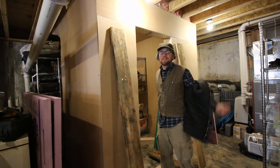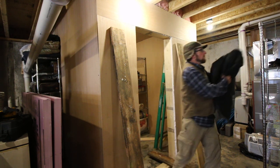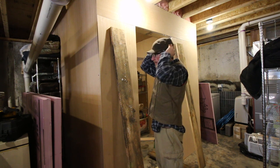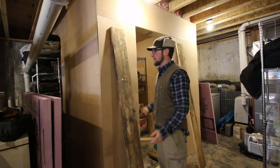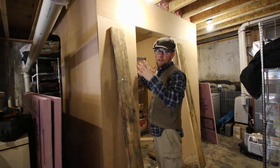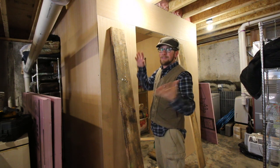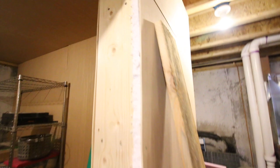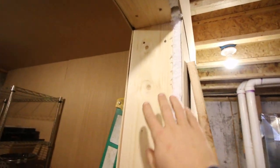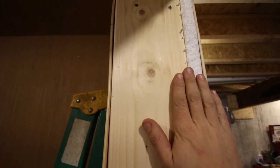I almost forgot — we've got to case the doorway out first. I ripped down three pieces of one inch thick rough sawn lumber that we got from our lumber yard. So let's get the doorway enclosed and then we can figure out how wide and tall we need to make the structure for our door. The reason I want to case the doorway in is you've got our paneling, our two by six, our foam board and more paneling — and that's just ugly, so let's cover that up.